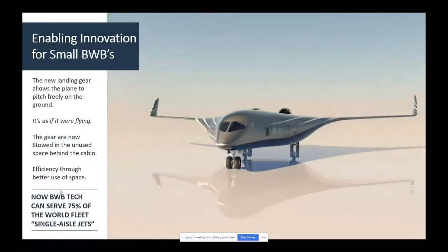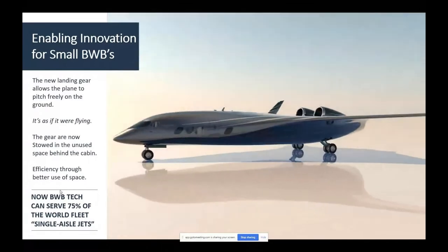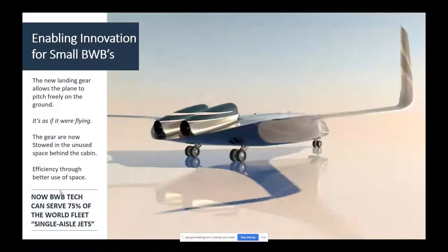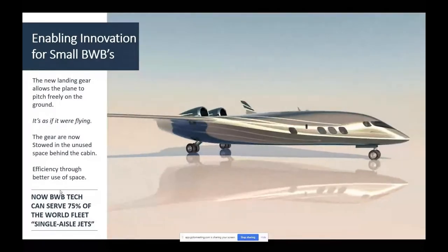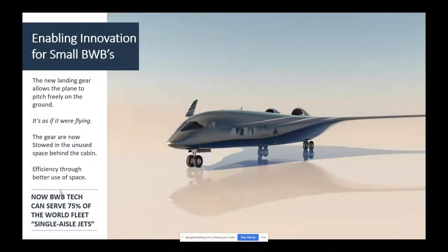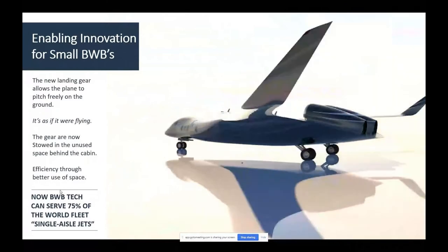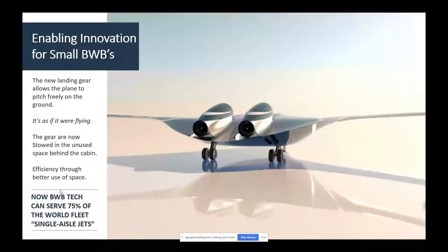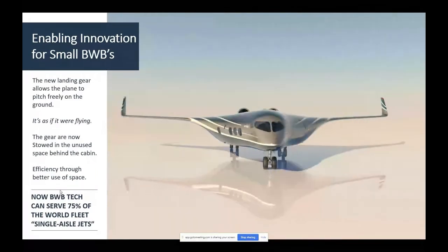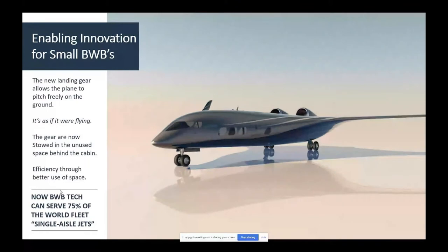But here we wanted to get rid of all that wetted area of the bottom of the nacelle, the top of the wing where it's in the shadow of the nacelle, and then the sides of the pylons. We said, wow, we could save a bunch more drag and weight if we can snuggle this in. So we've done that. I'll show you a little bit more about that. We're not eating the boundary layer. We have a boundary layer diverter. I won't spend a lot of time on that, but that's a key part of this. So the engine doesn't eat muck. It's the same old engine I fly on, a 737 MAX, a geared turbofan engine.